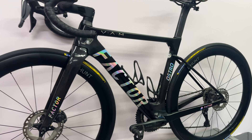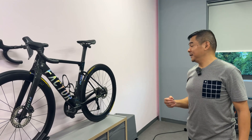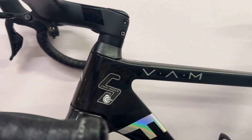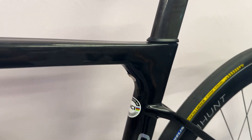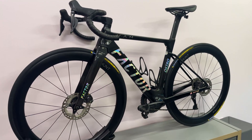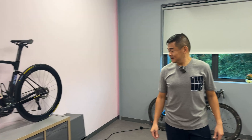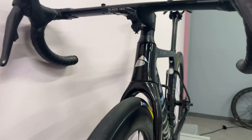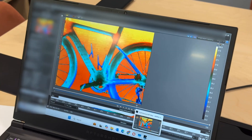So this is a fork that belongs to one customer. Jerome, this one is perfectly normal from the outside right now — it has been beautifully repaired and painted. Yes, but actually there's an issue with this bike. Let's have a look. It looks nice — from what I'm seeing right now everything looks like a new bike, you won't be able to tell whether there are any cracks or not. But this bike has been resprayed and fixed. Through the scan, Jerome will be able to see all the defects on the computer. This is one perfect example where from the outside you cannot see what's going on, but with the thermal scan you'll be able to see some of the damages and repairs that have been done.